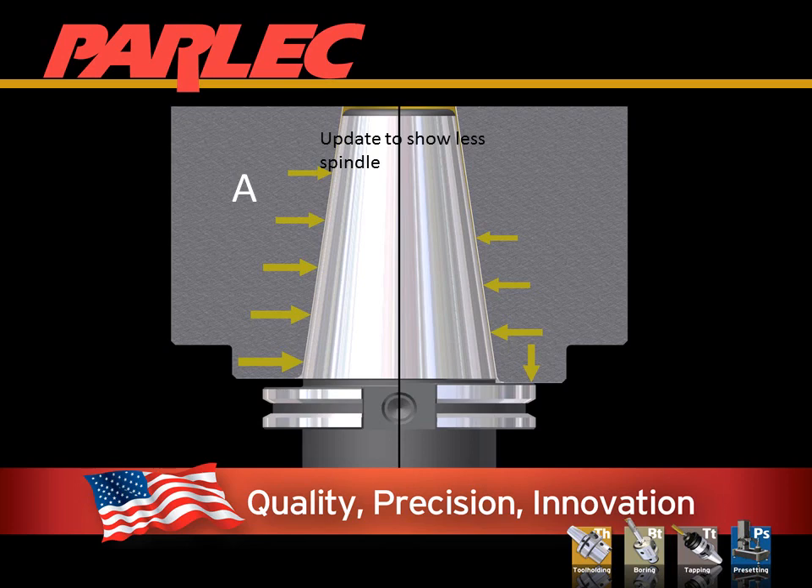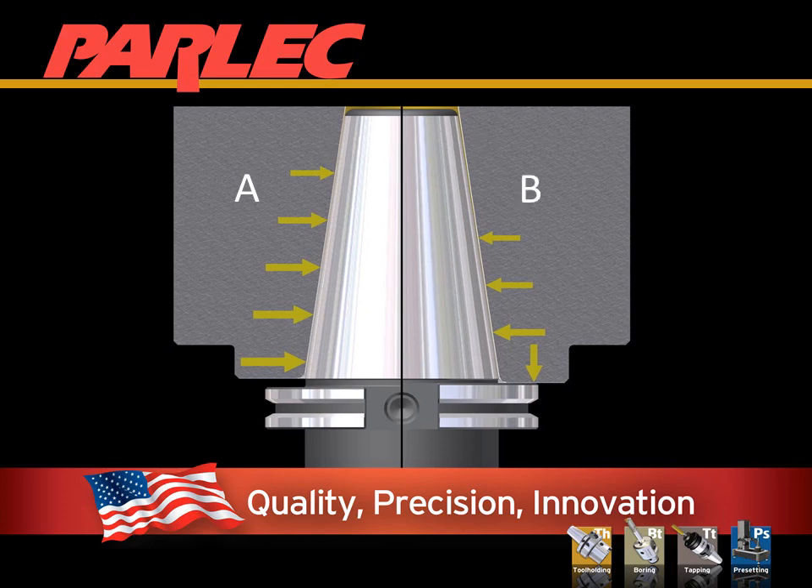In this image, A represents the force of contact from the spindle. As the taper is pulled into the spindle, the ID will expand to meet its form, creating contact almost the entire length of the connection. The further from the gauge line, the less expansion is required. On side B, because the Simulfit connection restricts the amount of draw, it is safe to assume that only about half of the expansion takes place. This can leave the small end of the taper not fully engaged.